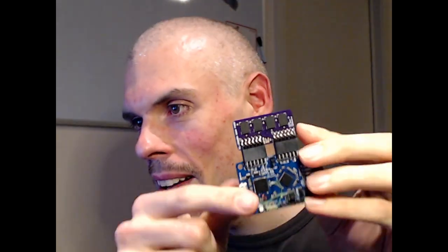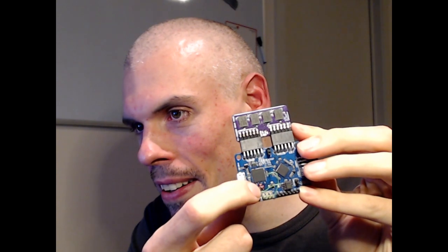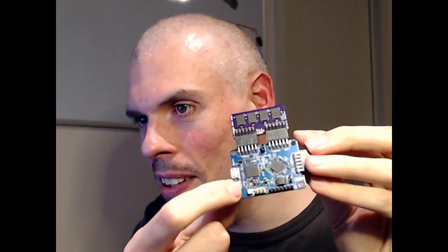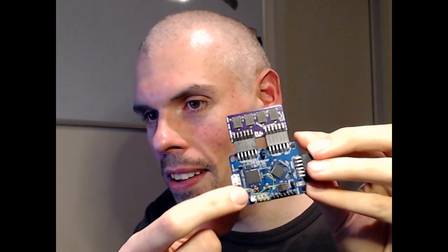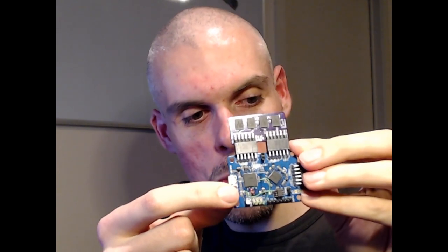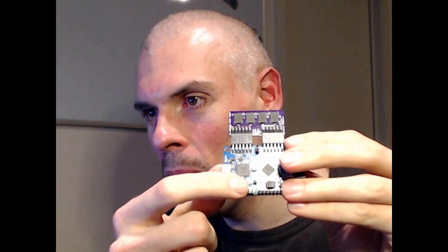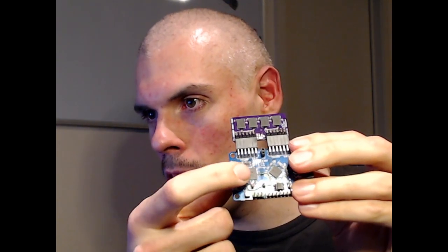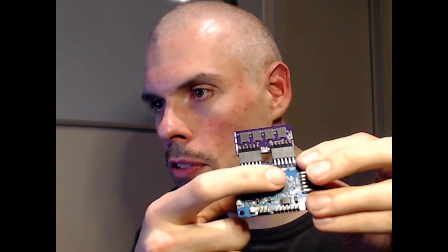Yeah, it's still my bot version. The small red wire is the chip select that I connected manually. That green wire here is because I completely tore one of the traces that I had to replace, the UART transmit trace. I destroyed it, so I had to connect it back. And then there is the chip select for, you can't really see it very well, but above the flash chip, I connected SPI PSRAM, and that's the chip select for that.